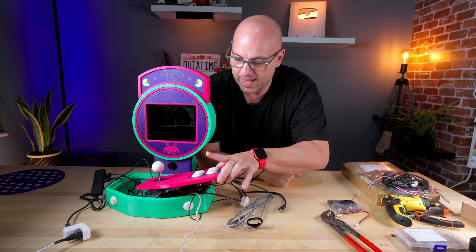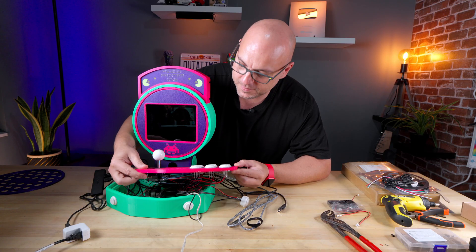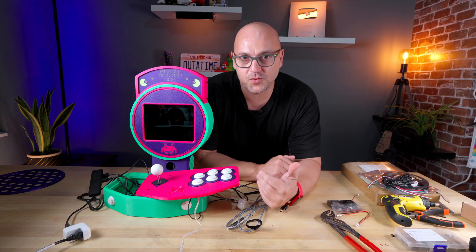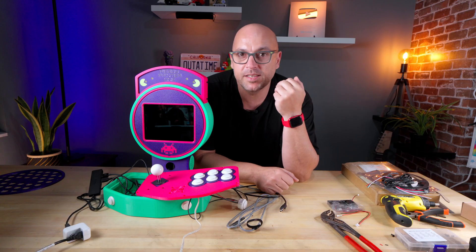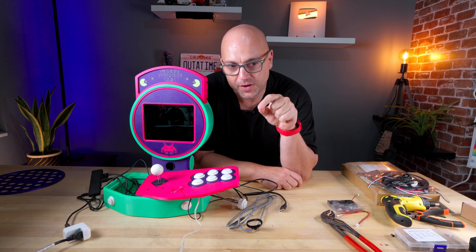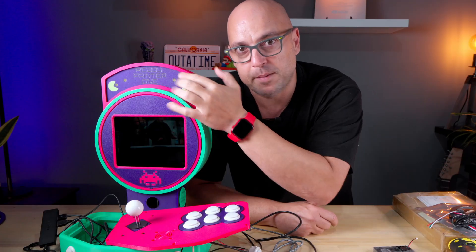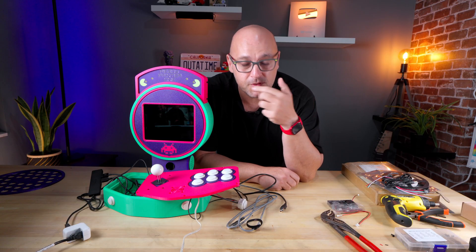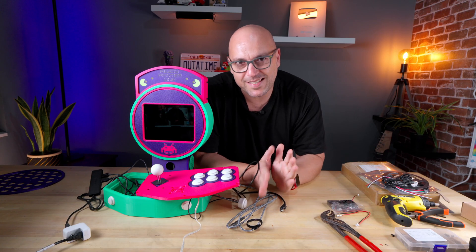The first issue was that the wires for the controller are not long enough, so I cannot move it into place — I'll need to extend those. Secondly, I had a problem with the screen: it would light up for a few seconds and then go off instantly. I tried different power supplies but they wouldn't work, then I realized every power supply I tried was 2.1 amps. I eventually found a 2.3 amp power supply for the Raspberry Pi and it worked. However, when I tried to connect the LED strip that powers the marquee up top, the screen would start flickering, meaning it was drawing too much juice.